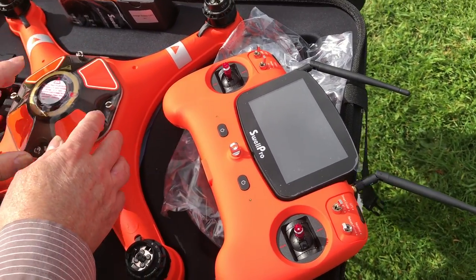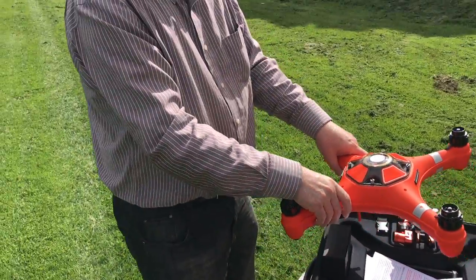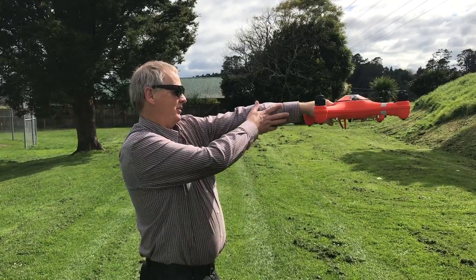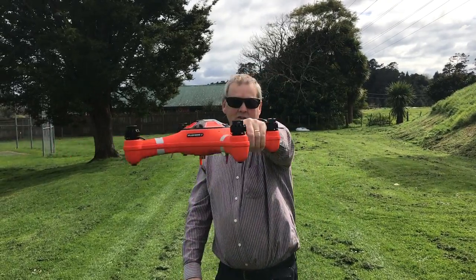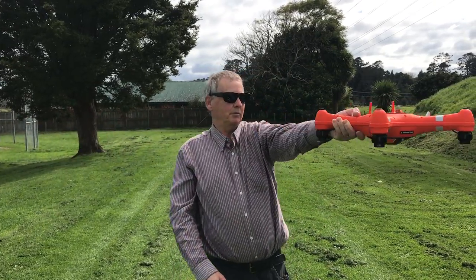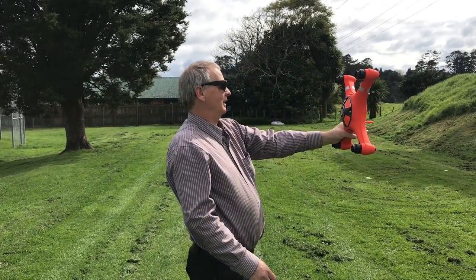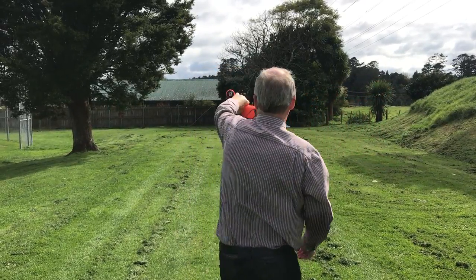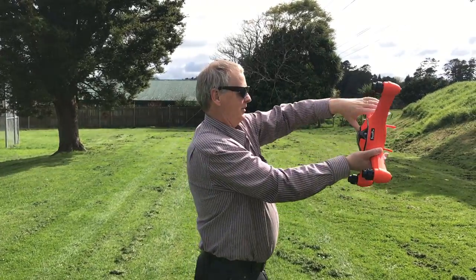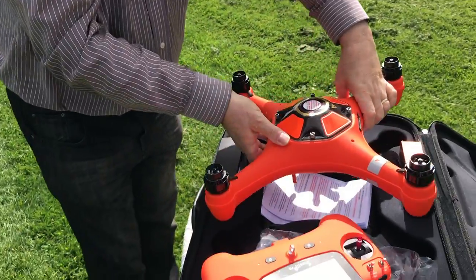Pop the lid back on, making sure the arrow is facing the front, and put a couple of screws on so the lid doesn't fall off. Hold the drone with your arm straight out — it's really important to keep it level as you rotate it. Rotate it 360 degrees around the axis, then invert it upside down and do the same. Then with the two stripes facing up, go around again. Then stripes facing right, go around. Then stripes facing down, rotate 360 degrees, keeping it all level.